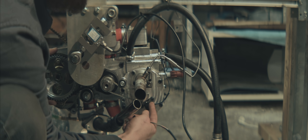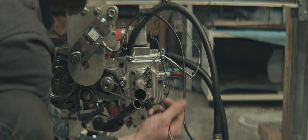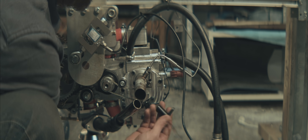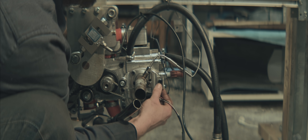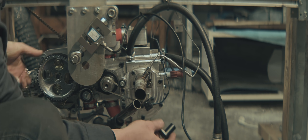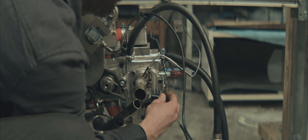I'm utilizing the existing trigger wheel. The Ignitec ignition unit can output a tachometer signal, but it's 12 volts and yourdyno needs 5 volts. I could use a voltage divider or an opto-isolator, but this is just quicker. Yourdyno really wants more pulses than this one trigger point provides, so you'll probably need to fabricate a multi-tooth trigger wheel after initial testing. But this will work for now for testing purposes.